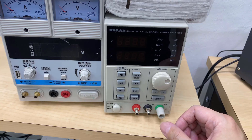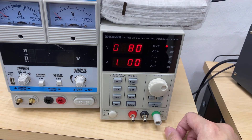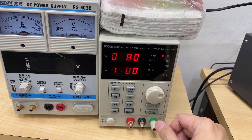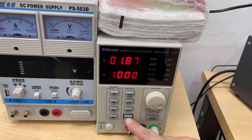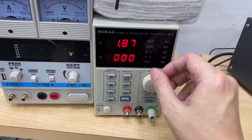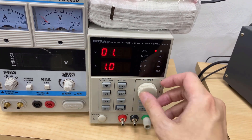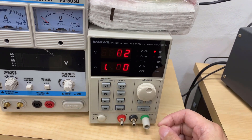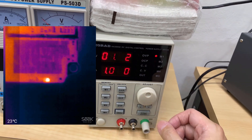I don't use this one a lot because I don't repair laptops. And this machine has one weakness I don't like — it does come with 3-digit values behind the decimal, but every time you need to adjust the voltage you need to press this button. This button is an on/off for the output, so when the output is on you cannot adjust anything — you can only adjust when you turn off the output. So it's not convenient, especially if I want to do the ramping technique such as high-low, high-low. That's why I don't often use this one.